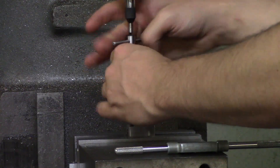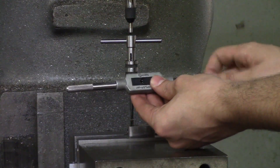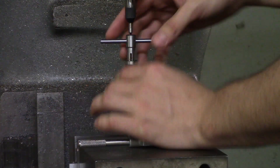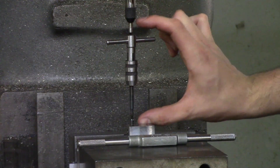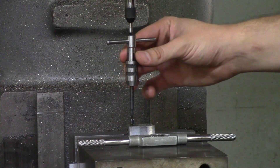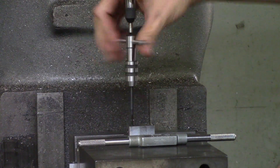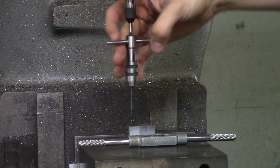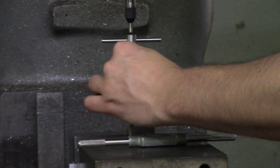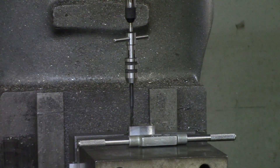At this point, we can take it out of the T-shaped handle and use a flat tap handle, because with a flat tap handle you are more rigid. With the long extended tap handle, you have more chances to break the tap. You want to be sure that you're tapped all the way down, so we're going to take it out, blow it off, and re-tap it. Just keep repeating that same procedure until you know you're tapped all the way down.